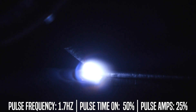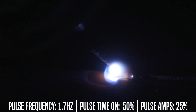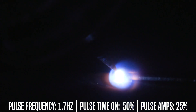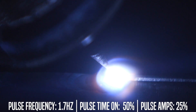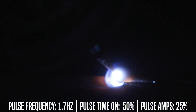We're going to do three welds. The first one we're going to do at a lower pulse rate, 1.7 Hertz. I use 50% time on, 25% background, 1.7 Hertz and 1.7 pulses per second. That's going to give you a nice dime stack look, a real uniform dime stack.